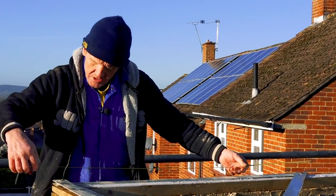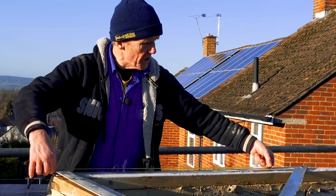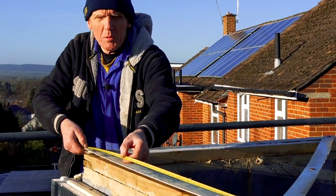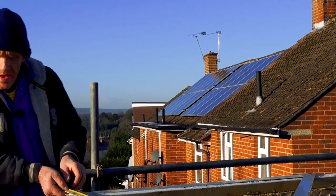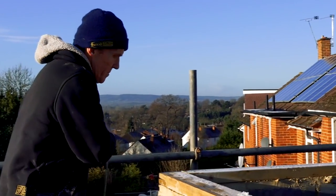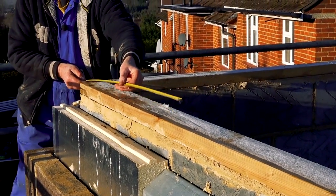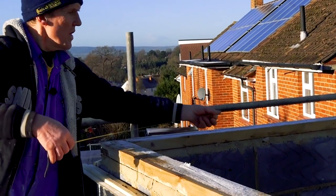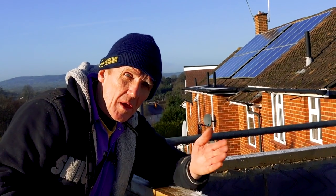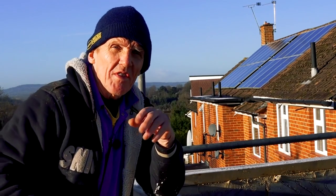In other words, you take any three numbers in that ratio. So if we take 30 inches from the corner and mark across there 30, then on the other side we get 40 — it doesn't matter what the unit is, just so long as the ratio is the same. We mark 40 on there. We don't need the square; we can mark this on the plate. We go 30 on one side, 40 on the other, and if it's square, the distance from that mark to that mark will be 50. If it's not 50, you either move that one in or move that one out until you get 50 dead on, and that will give you a perfect right angle. That's the way it's been done for thousands of years.